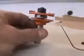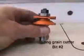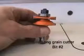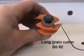This cutter is used to produce the tongue on the end grain of your door parts. A long grain cutter has the ball bearing on the top of the bit. Again using a felt tip, write a number two on this bit since you'll always use it second.